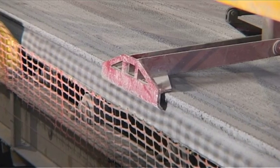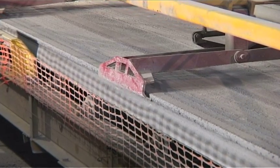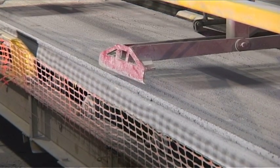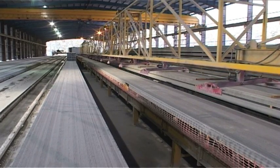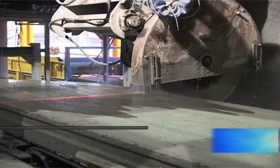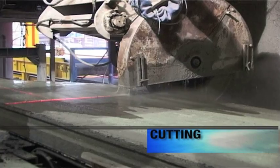The mark 3 line is a fully automated sequence of cutting stations integrated together for the production of pre-cast units with millimeter accuracy. Once the 64 meter length is placed on the conveyor, information is sent by the design engineer to the PLC. This controls the sawing stations where the end product will be accurately cut.